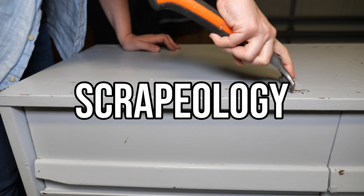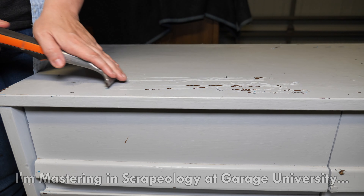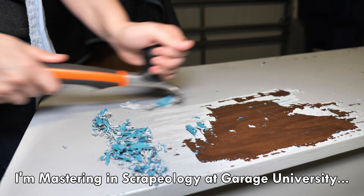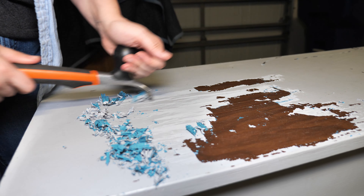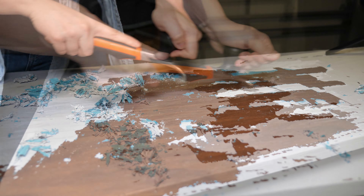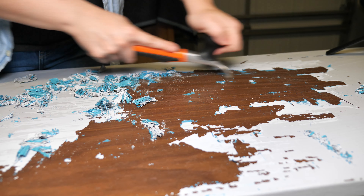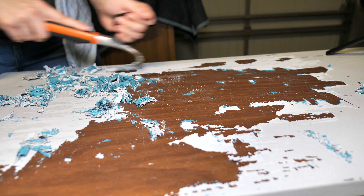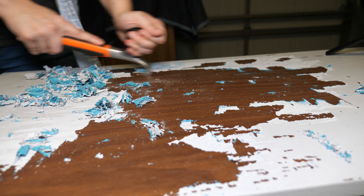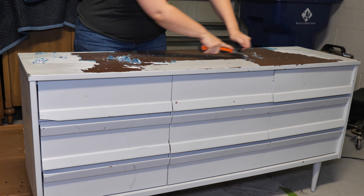On pieces like this, I prefer to start off using a paint scraper. This cuts down on the amount of paint stripper that I may need to use, if any at all. Based on the peeling paint on the top, the leg, and the underside of this dresser, there are going to be two layers of paint that have to be removed. The first layer is gray chalk paint, and I believe the blue is a latex-based paint. The gray looks like it's Rust-Oleum chalk paint, if I had to guess. Using the paint scraper, while it's an additional effort, will alleviate the need for two to three coats of stripper, and on a piece this size, that could easily be one container of stripper.